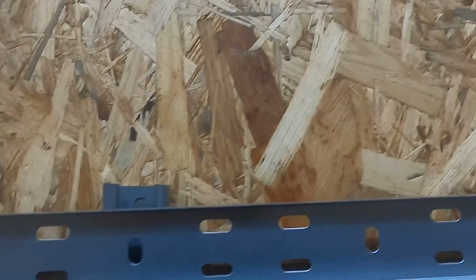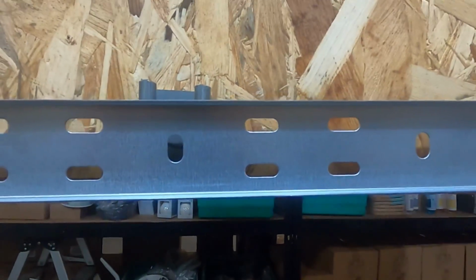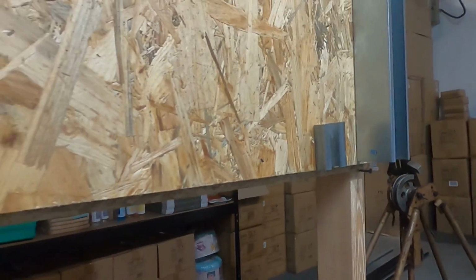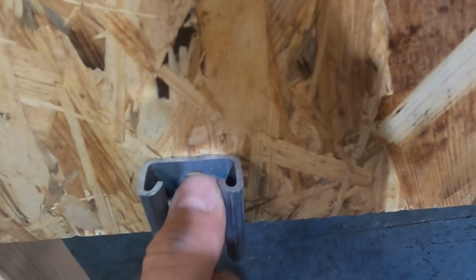So what we've done for this cable tray is we've put bits of Unistrut up so we can stick it on here. And what is normally done in industrial is we use ZEBs. So I'm going to stick some ZEBs inside this shallow strut, this one, and fix this Unistrut up. So with these, the ZEBs just fit in there on the strut. You can get long springs or short springs, but they're spring loaded, so they just sit inside so you can fix the strut on. I'll show you that now.